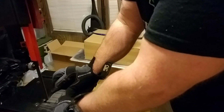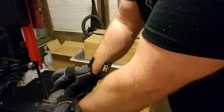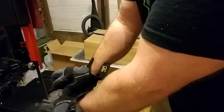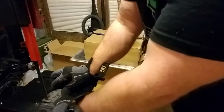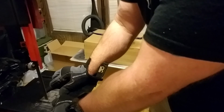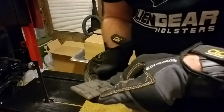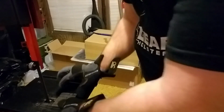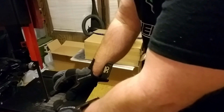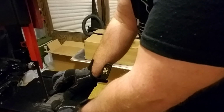but after we do that, we'll come home, we'll get the grinder going, and we'll get these all ground to shape. And I would say that by the end of the day tomorrow, God willing, that we will have these to final shape, and we'll have the ring holes drilled and chamfered, and in fact I'll probably have these dressed around the edges all the way to 600 grit where I'm going to stop, and I'm not going to bother with surface grinding them until a bottle of etchant comes in.